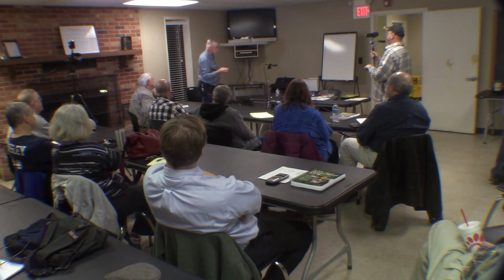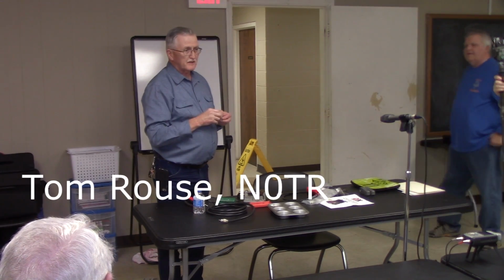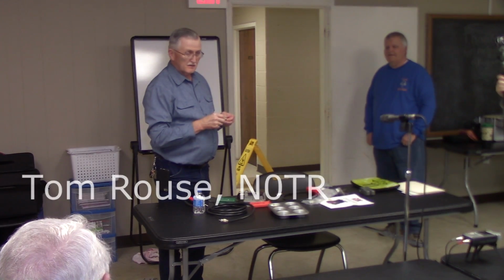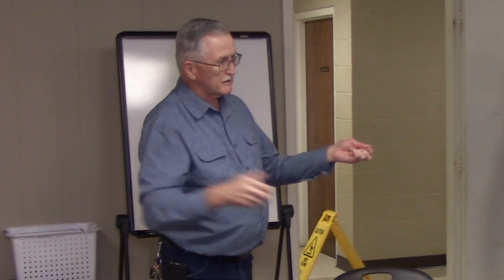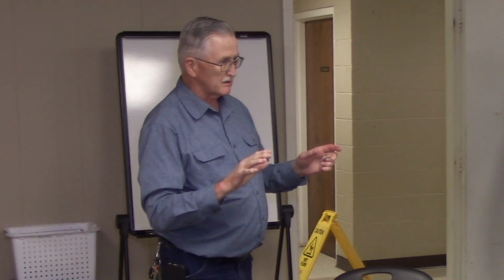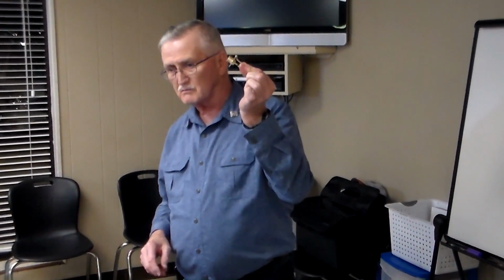This may not be correct or not. It's an old-timer's way of doing things. Whenever I have 235 feet of coax before I get to my antennas, I take this little device here, which is merely an SO239, and it's shorted. I go out there and plug my antenna wire in, go back to the radio, and measure the resistance with a very good Fluke meter. A year from now, I'm having problems and I want to eliminate just the coax real quick. You don't have to take a jumper, and the jumper falls off by the time you get back in the house. That little SO239 works really well.